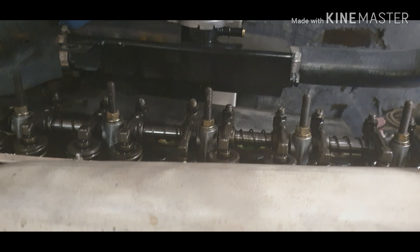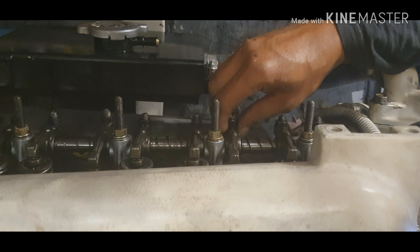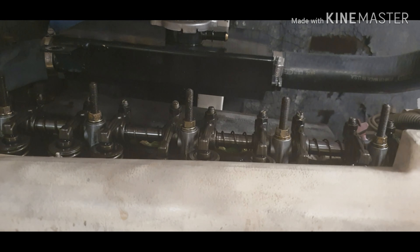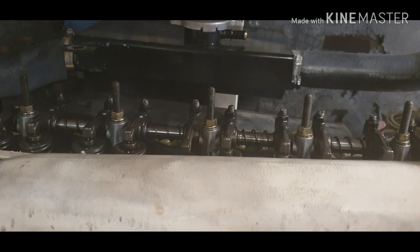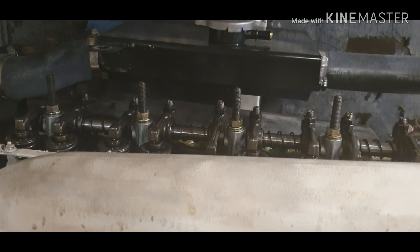This one has five cylinders, so there are five valves — wait, one intake and one exhaust per cylinder means ten valves total. So we're going to check if the clearance is still within the correct specification. We'll use a feeler gauge to get the right measurement. This is a big job but no problem — we're professionals. I have a good engineer who has worked for many years, previously at Saudi and Mercedes companies. He's a specialist, so fully trusted.